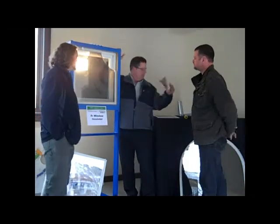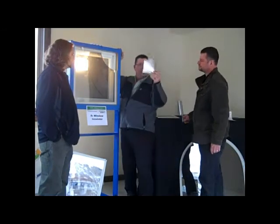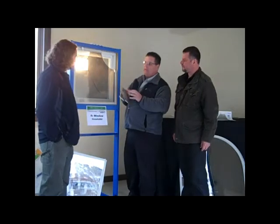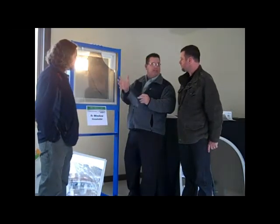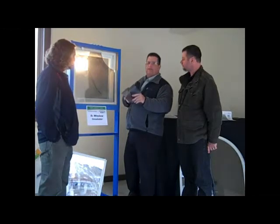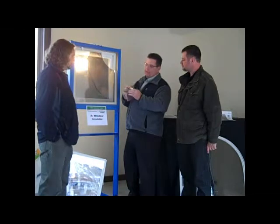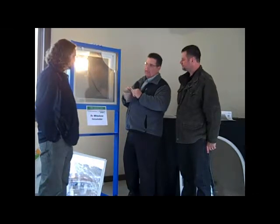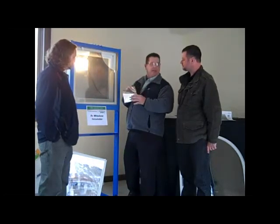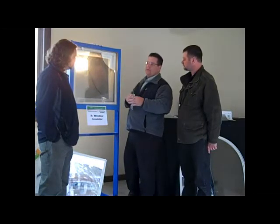What that does is allow you to look out through the product — you see right through it like a screen, but most screens are black. You see all these shades and windows, they're all solid black. The sun comes in and heats them up, and you get all that solar heat gain in your house. But with this one, because of the pattern, texture, and deformation we've put on the tiny-size holes, we keep the sun from coming in about 75 to 80%. 80% of the sun will be reflected out before it turns into energy.